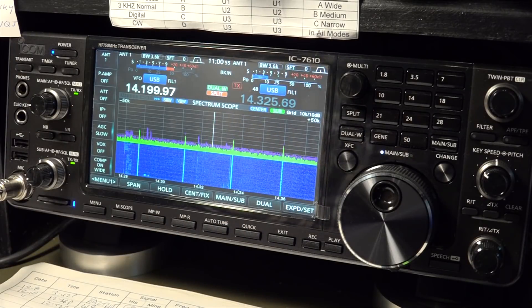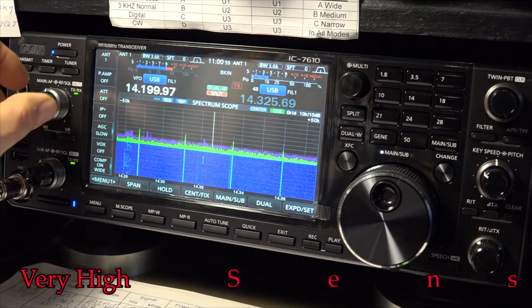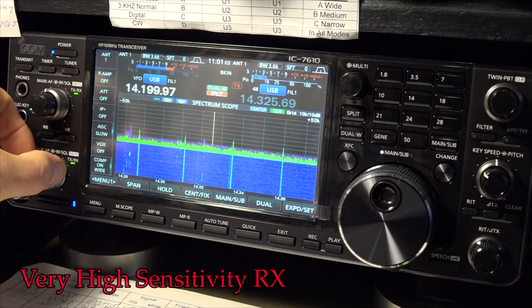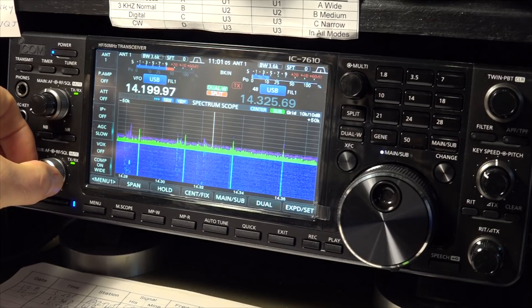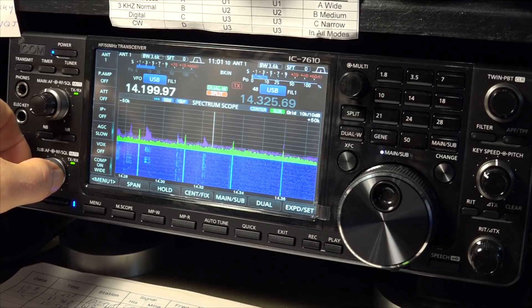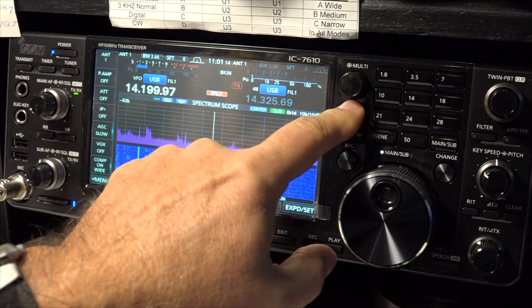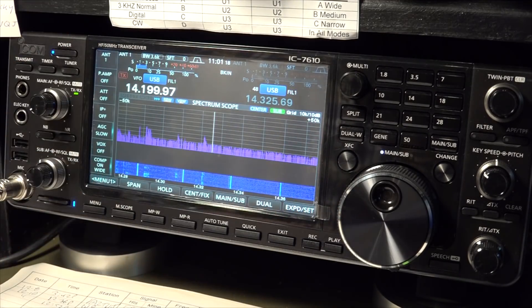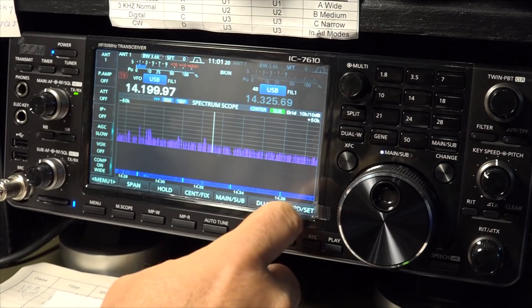The sensitivity also seems to be higher than my other radios, about 3 dB higher. I'm talking about the noise floor — you're seeing a little bit more hiss because I have a lot of locally generated hiss, and the signal itself is stronger. It's very interesting that compared to the others, that is the case.